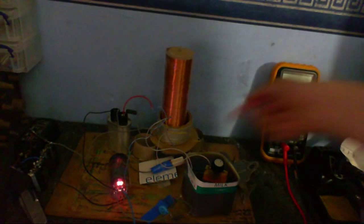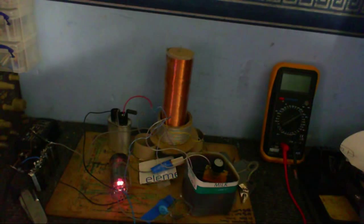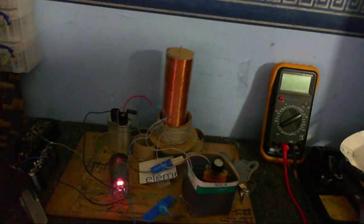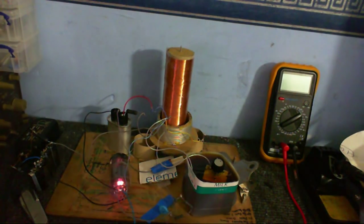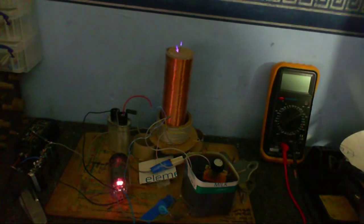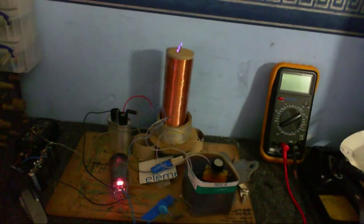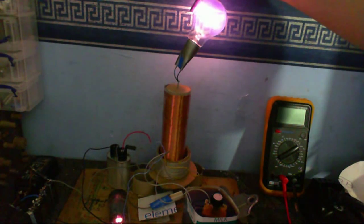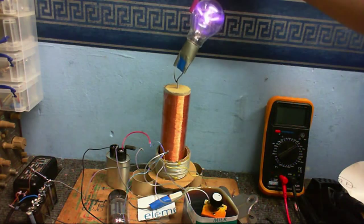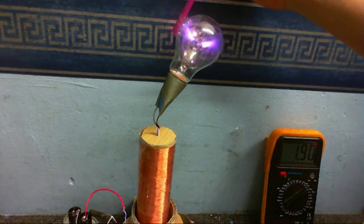I still think I get the best results with this coil here, and the tuning capacitor set to about here. So I'll show you the trick with the light bulb again. Let's just plug it in, make sure it's oscillating — yep. We've got a little bit of plasma leaking out the wire there. And now here's the light bulb. Look at there. There is a bulb turned into a plasma globe.